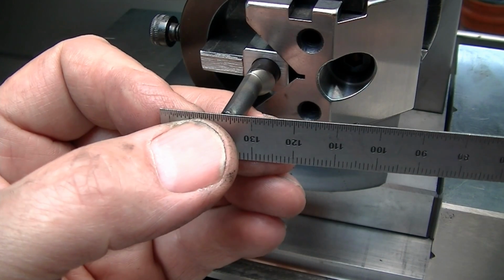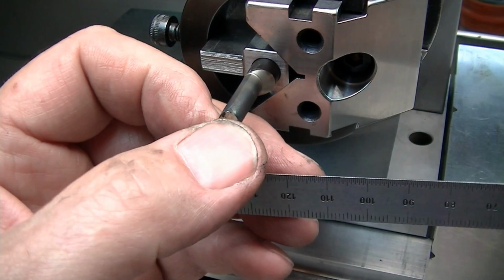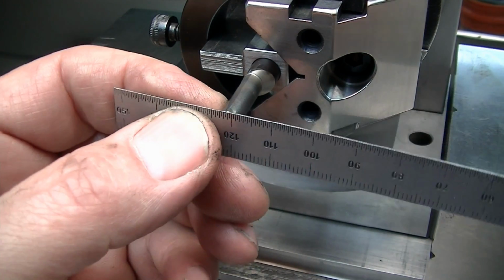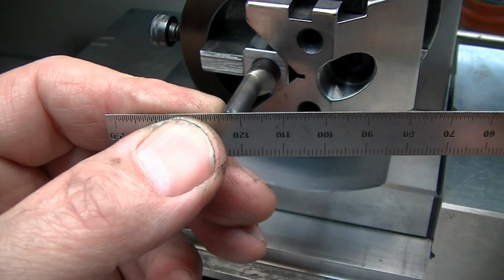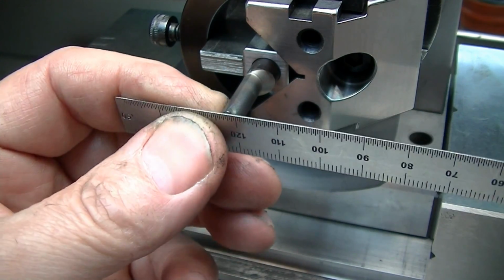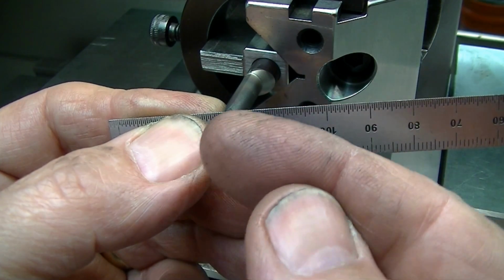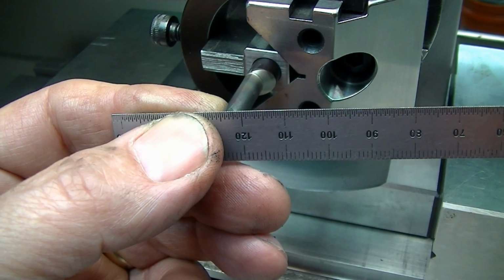Now this will be the first actual operation that is the real deal for redoing these heads. So I need to clean off this surface, hopefully just touching back to where it was originally. What I'm doing there is I'm doing my angle this way, my 3 degrees in this direction for my side clearance, this being the front of the tool, so it's falling away this direction. And then to get clearance this way, I'll be tilting the part so I get a flat like this. So it's 3 degrees this way, 3 degrees this way. That forms the compound 3 degrees both directions on the back side of the tool when I solder the flat carbide onto it. So we're going to flip this around and do the real deal on the correct orientation.